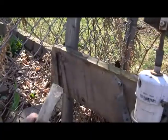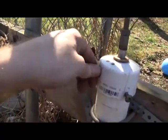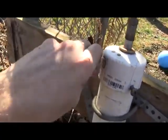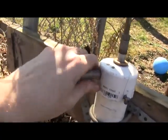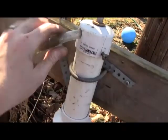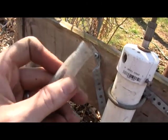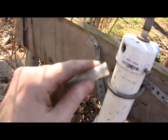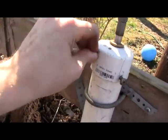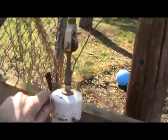The next step is to put the hose on — 5/8" hose. I just kind of manhandle it in there. With this cut the way it is, it kind of captures it. If you look closely, you can see where it's flared out, so it captures it from pulling out, which is nice. Just cram it back in there. And that's it — the pump's put together.